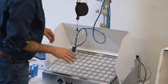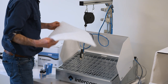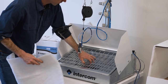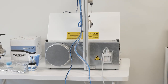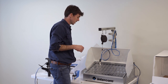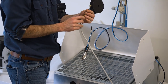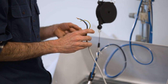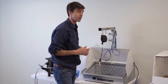This system also includes ventilation with a layer of filtration underneath the bed and one on top as well. On the backside there's an exhaust — you can either cap it with a filter or vent it out externally, though just the cap should do fine. There is a small electrical requirement of 220V. We ship it without a plug cap since production facilities may require different outlets. If you're using 110V, you'll need a converter, and you may need to hire an electrician.